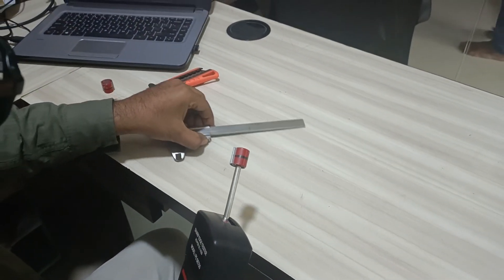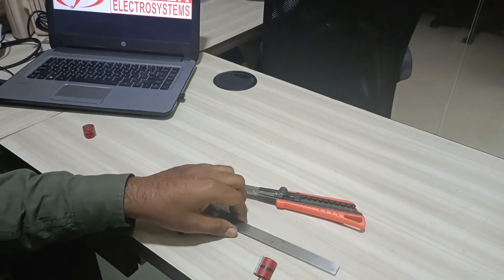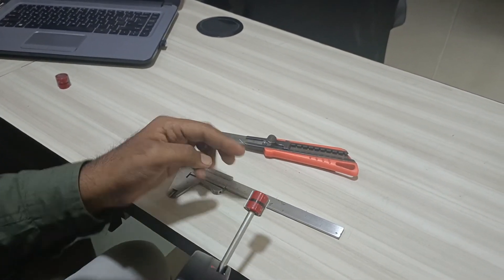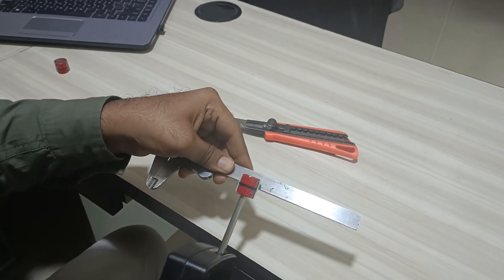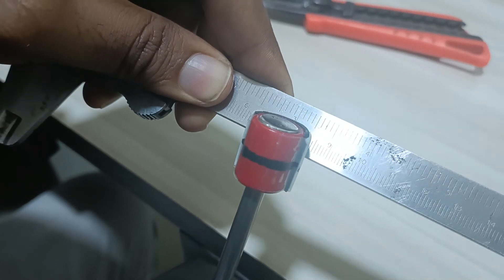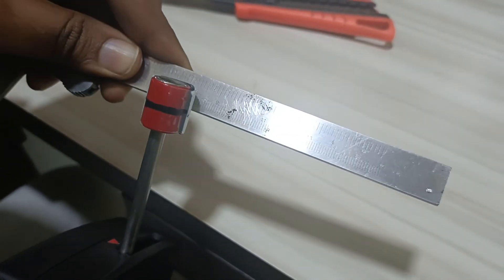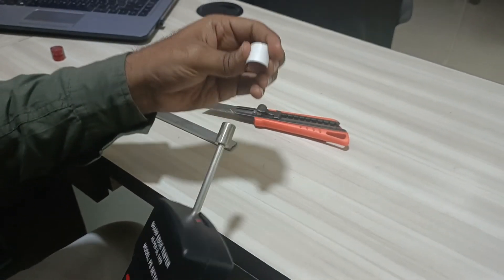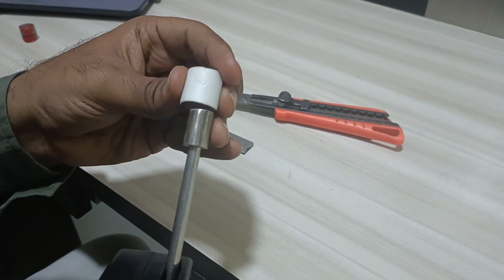As an example, we are testing it on two probable sharp edges — one is this blade and one is the edge of a vernier. To test this, you place the tape facing the unit, press this, take it to the pointer and go 25mm right, 25mm left, and then you inspect the tape. If there are no dents or scratches, this is not a sharp edge.